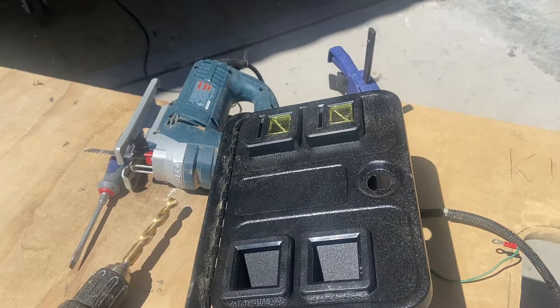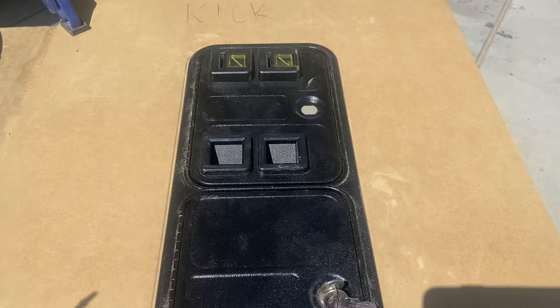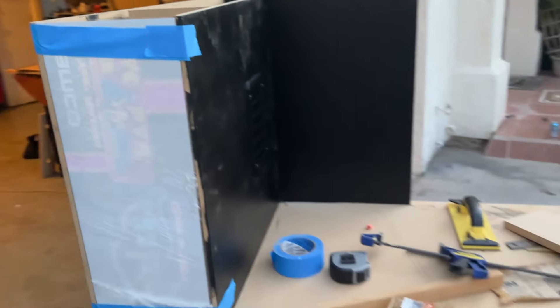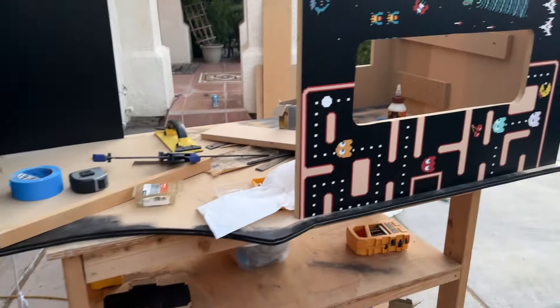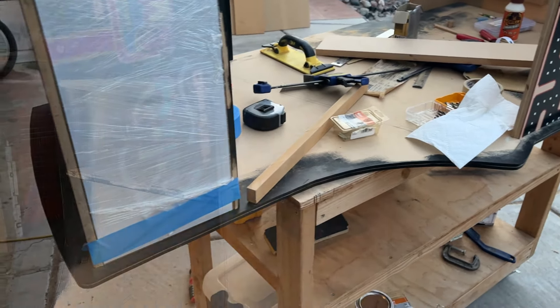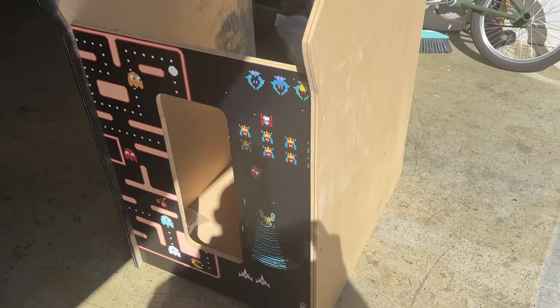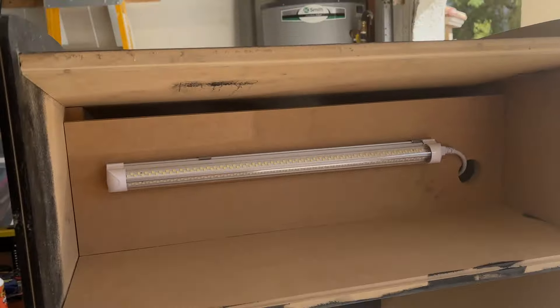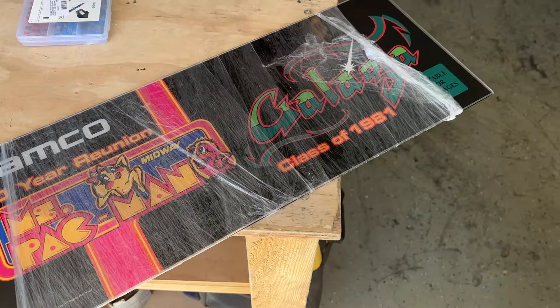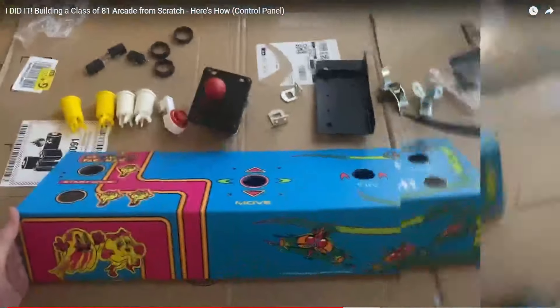I made sure I used the correct coin door for a Class of 81 — it's a two-door top-and-bottom design, not a single door. On pieces like the kick plate, I put the artwork on first. I drill the screw holes in from the outside of the side panels into the sides of the kick plate or cross member pieces, so there are no visible holes or screws from the front. Once all those pieces are done, attach them to the side piece. Once it's all together, put the other piece on top, screw them into the sides, make sure your marquee section is complete, drop a light in there, and you're good to go. I did bust my marquee — I dropped it and cracked it, had to order a new one.